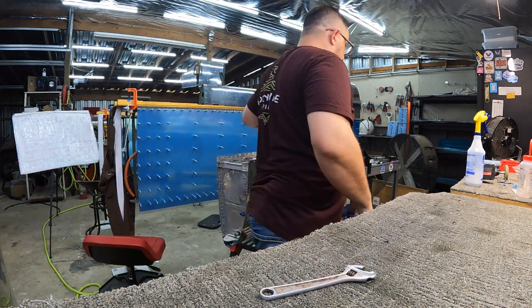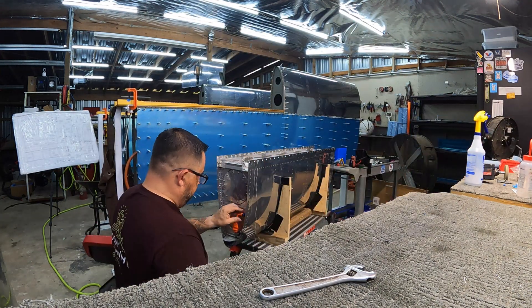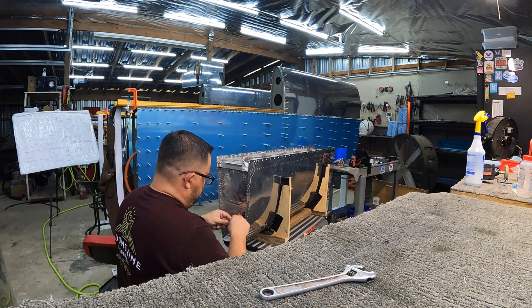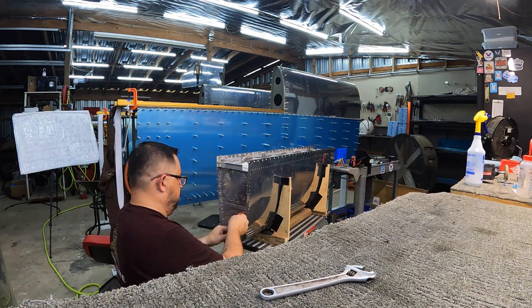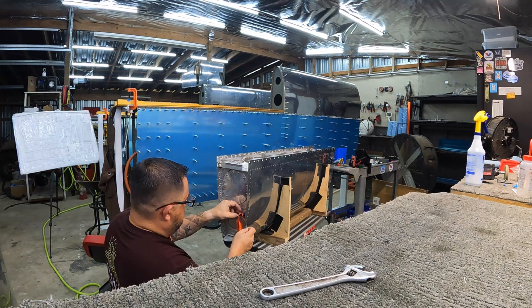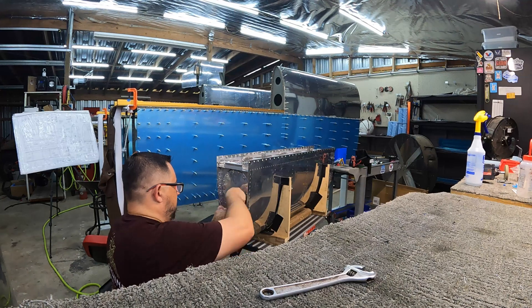Here's the first leak test for the left tank. When I built this one, I applied everything I learned from the leaks on the right tank to make sure I didn't have the same issues. I'm still happy — most of the tank is dry. It's just that top edge of the baffle that I had problems with. It could be way worse — could be on the bottom of the tank. Theoretically there shouldn't be fuel sitting there all the time, but still better to get it fixed.